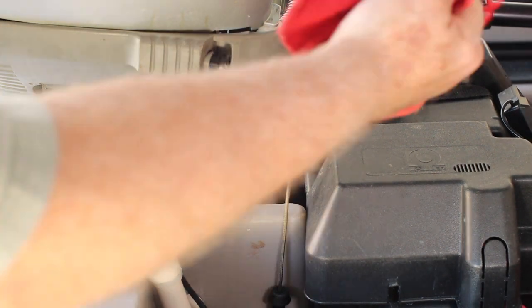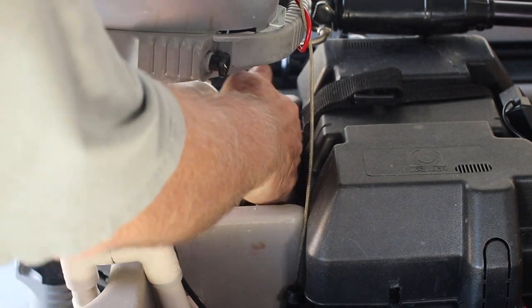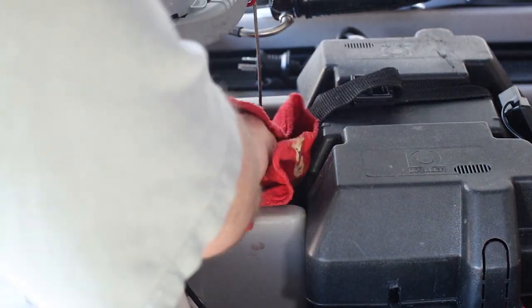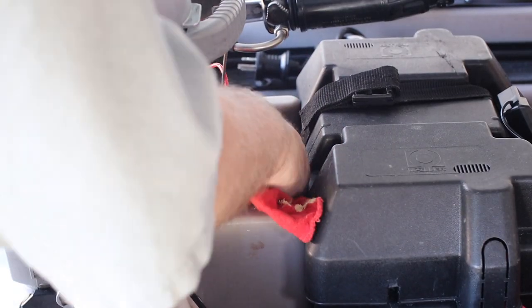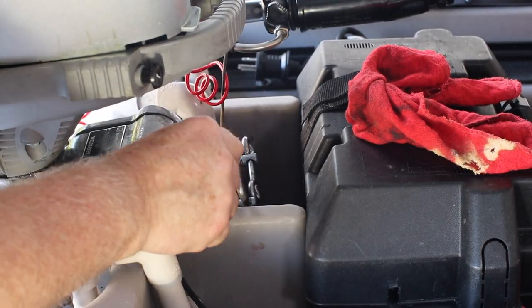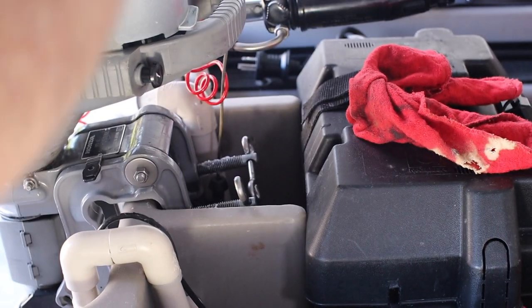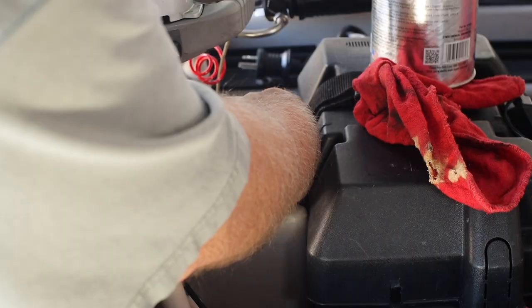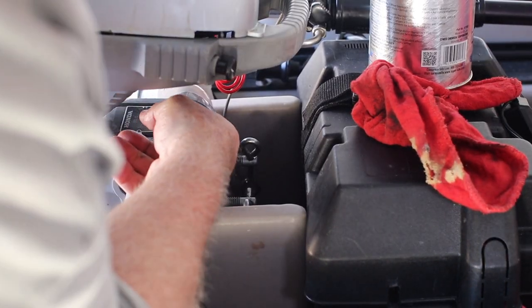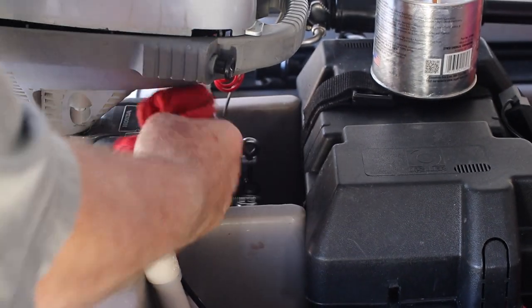The clamp that holds the motor to the transom has these big long bolts. Let me loosen them all the way out. Those bolts we lubricated in the past so you can see the dark grease on them — it's in an area that I sometimes put my hand and I don't really want them all greased with black grease. I'm just taking a swab and putting some Super Lube on the threads — not a big amount — closer to the part of the thread that goes through. Running this bolt in draws the grease into the threads farther in. Once done threading all the way in, it leaves a pretty good amount of grease pushed back out of the threads. Clean off both of those clamp bolts — wipe everything off and they're tight.